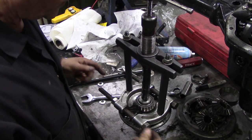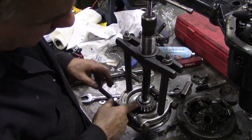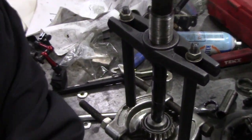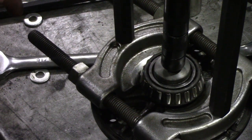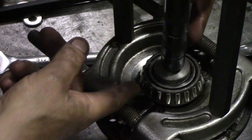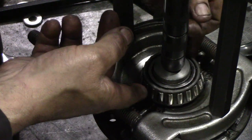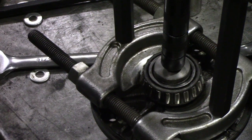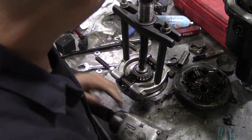What we're going to do now is just clench these bearing separators. You can see I'm pulling off the bottom of the roller, which isn't really ideal. But these bearings come with a little tiny cutout underneath the housings so you can put like a fork, but I've broken more forks trying to get them out than this. Since these are scrap bearings it's worth doing. Cover your ears — I'm just going to tighten up these bolts.